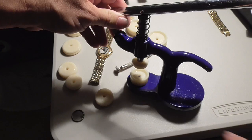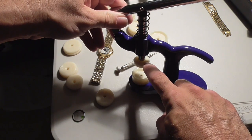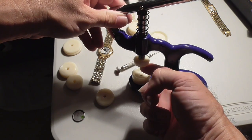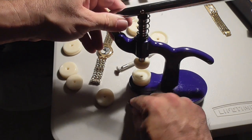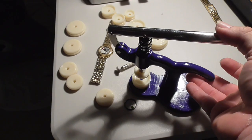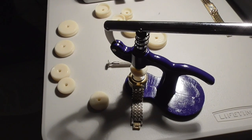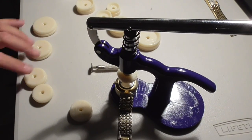I've got the top and the bottom. Inside here I have number 32 facing up on one side and number 26 facing up on the other — so you have a choice of using different sizes to protect the crystal from being cracked. I'm using a smaller piece to do the pressing onto the back. I don't really need a large piece; I need the force going around the edge. Then I'll squeeze the handle and if it works right, there should be a little pop — or even if there isn't a pop, as long as it presses shut, that's the main thing. Make sure you do not have the stem of the watch pressing on the outer rim.